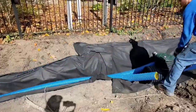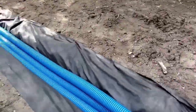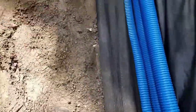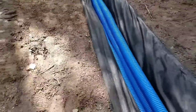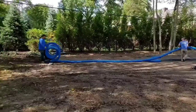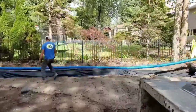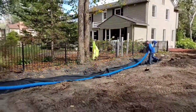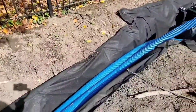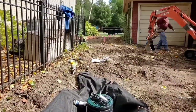This is a quad pack. You've seen the trees - we're actually building right by a couple of trees and I'm not worried about it because with all this void, all these pipes, all that air void, roots can't survive. As long as your sump pit for your screaming demon is deeper than your trench, you're not going to leave any water behind - a root can't survive in four pipes with all this ventilation. It'll just dry up and fall off. You can see the guys are just pushing the pipes down into the sump pit.